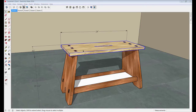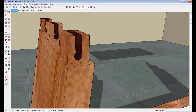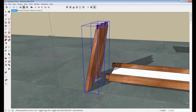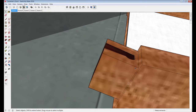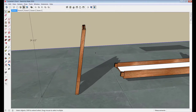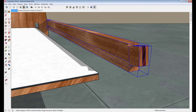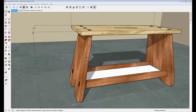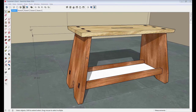It's all wedged tenons. If we select the top piece and use the move tool we can raise it up 10 inches and zoom in to see how the wedge tenons are modeled, and you can see the legs are set up the same way. If we slide this over and explode the model, you can see how the tenons are wedged going through mortises in the legs — once glued and those wedges driven in, it would never pull apart. The tray just fits in between the rails in the dadoed slot. When the stool project goes to the shop the various corners will get rounded off slightly; I don't do that in SketchUp because it just adds polygons and slows the model down.